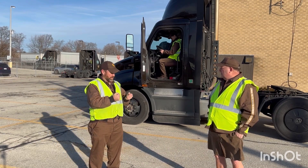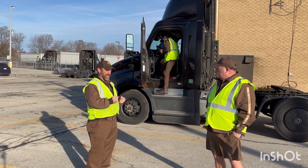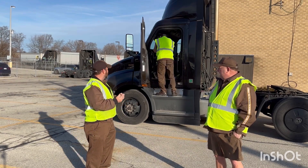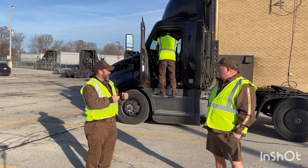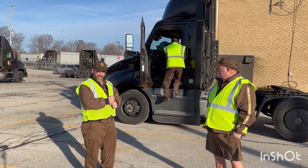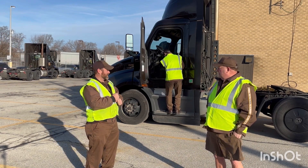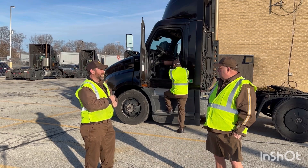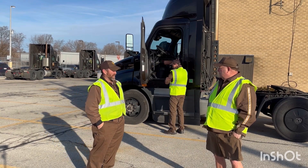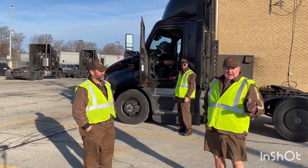Then I'm going to make sure, like I did going into the tractor, I'm going to have the steering wheel with two hands. I'm going to step out onto the top step facing the tractor — at that point I've got four points of contact. Then I'm going to reach to the handle and grab it with two hands, step down to the next step — again four points of contact — then step to the ground. And that's the safe way of getting out of the tractor.